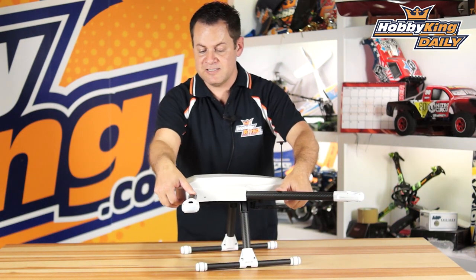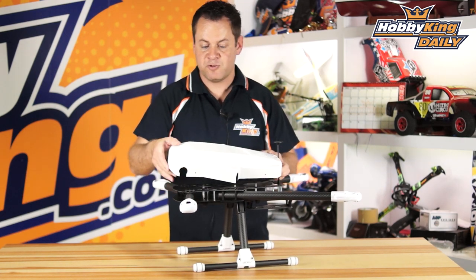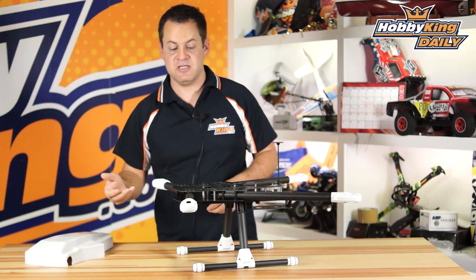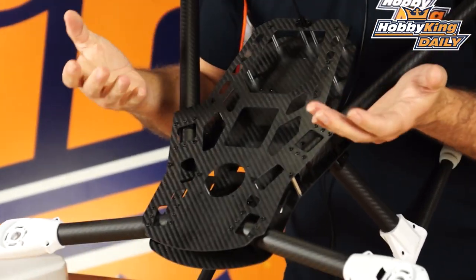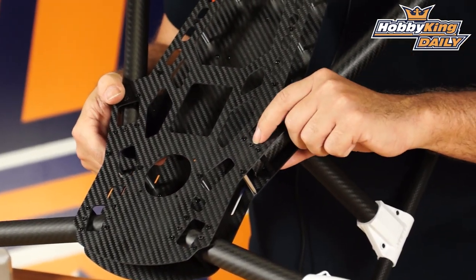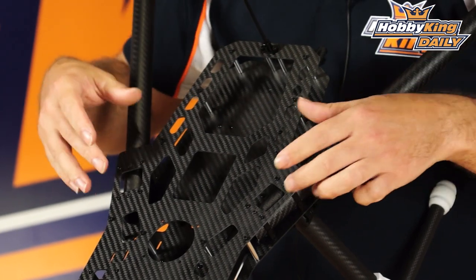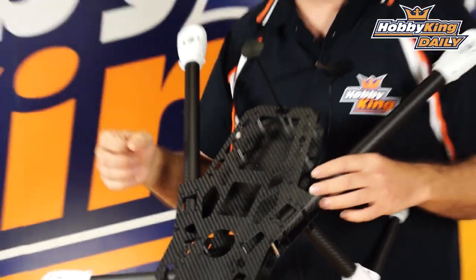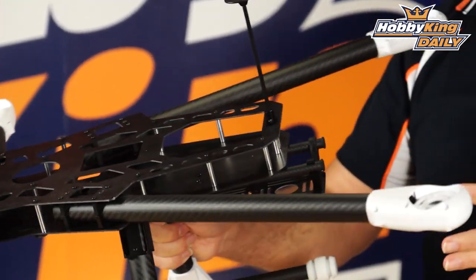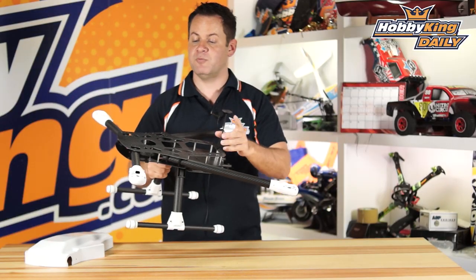Let me pop this off so you guys can see the inside. It just snaps on there. Really nice and thin, light, and easily paintable because it's white so you can paint it on the exterior. Basically like a work of art — all beautiful carbon, minimalist on the hardware but extremely strong. These are timed motor arms, meaning the center pin goes through the arms so they can't be twisted or out of time causing weird yaw issues. Plenty of room through the center stack for your provisions. It also has a GPS pedestal right back here — all CNC aluminum, no plastic on that.